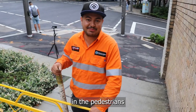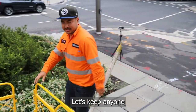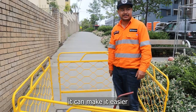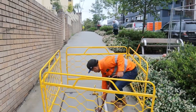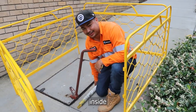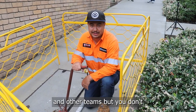Put a bit of a barrier between us and the pedestrians. Like I said before, we don't want anyone busting in — ankles, backs, face. A lot of personal injury happens with this, so let's keep anyone out of the penetration. We've got the lifters in. This is a one-man lift. If you've got two people it can make it easier depending on how hard and how heavy the pit is. So you want to roll the bar — have it lined up so you can have it a bit overhanging the pit entry. You don't want to have it inside because you might roll the bar inside and some pits are up to three and four meters deep and you're not getting that bar out without doing any confined space work.